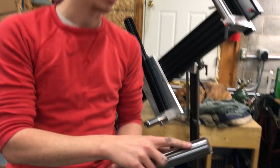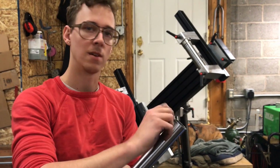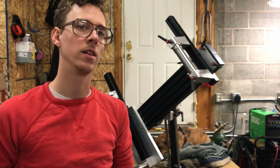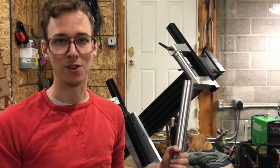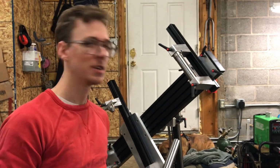Something like a Sharpie mark is good for crude work, but when you get into detail stuff, what you'd like to do is maybe make a scribble with the Sharpie and then scribe a line with something sharp, so you have a thin line quality, and you can come right up to an edge or something. And then we might end up making the cut 2 or 3 times to sneak up on it, since I only bought one of these tubes, which is, famous last words, right? Oh, I just bought one. I'll get it right the first time. So I'm gonna sneak up on it.